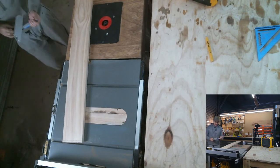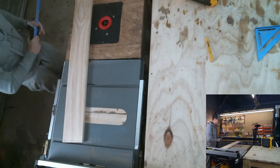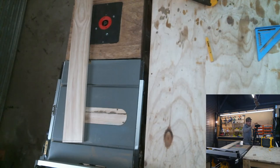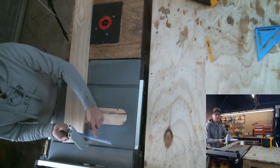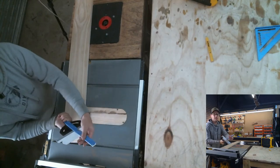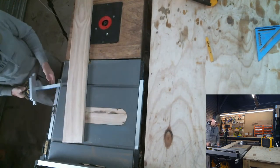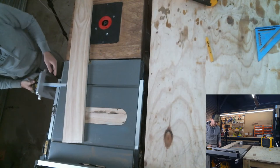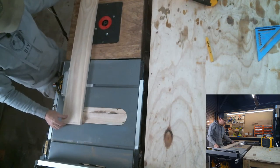so we're using this miter gauge, which is the DeWalt factory one. I know it's not the best one, but I did a video once where I did a review of that table saw, which showed how to actually fix that one, because the issue with that one was that it was wobbly in here. So what I did, I just put some masking tape around the edge, like around the bottoms, use the better ones, you know, that are a bit slippery, and it works really well. So it's good. Okay, and now it's solid. Okie dokie, a very long, chunky cut.